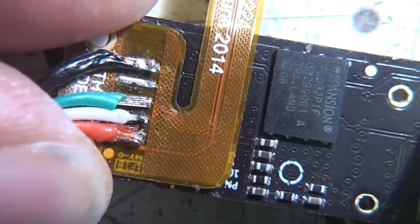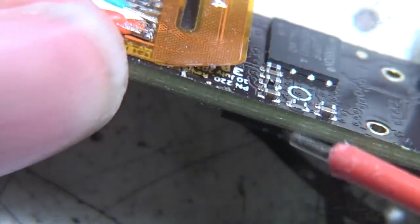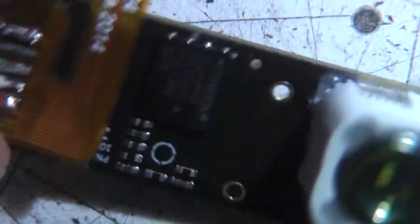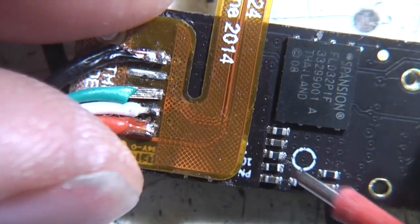Take a close-up look at this board. Not really a lot on it, as you'd expect for a minimum cost product. I don't really know how many layers. It's definitely at least 4 layer, could be 6. Now obviously it's a low-cost product, but the PCB is so small that the cost of the PCB is going to be minimal, even if it has to be a 6 layer.